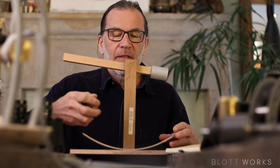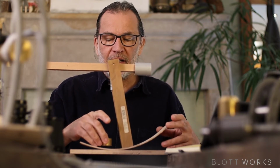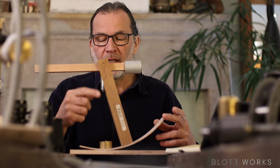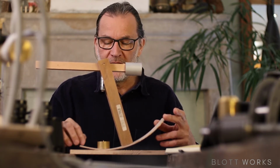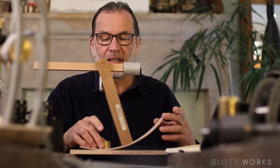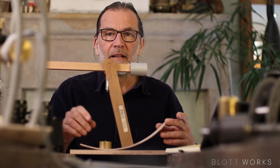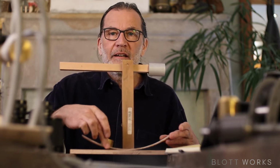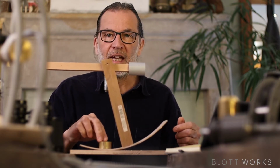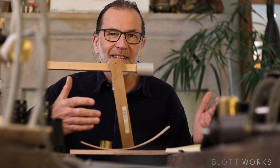So the first issue, which I'll use this to demonstrate, is that that's not that easy. What I loved about this was that horizontal line and the vertical line, this counterbalance, that bit there, is always vertical, and it points straight down to the weight that is holding this in position, which is the theory. But actually that needs to be an infinite weight, because of the leverage as you approach the point that you want it to balance at, which is the centre of this weight. The leverage between the point that's touching the desk and the centre of the weight gets smaller and smaller. So there's a point where this is always going to be at a funny angle, because it's never going to push down there where I want it. It'll always be back there. So that'll always be at an angle, and that will never point down to the weight. So that's a real shame, because I really like that.